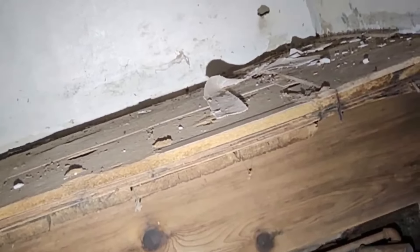Obviously that's going to be a repeated problem unless I get to the bottom of it. There's clearly a lot of moisture in here and we're in a drought, and that's mud — not soft mud but mud nonetheless. We're getting water in here and this crawl space needs to be a lot drier. I highly doubt roof leaks have anything to do with why there's water under the first floor — I think the biggest reason is that this is a hill that comes right up to the house, so water probably comes flooding down in rainstorms and pushes right against the block. Something needs to be done with grading back here, possibly with a drain pipe going around to force the water away from the house. The block foundation still looks really good, which makes me happy.